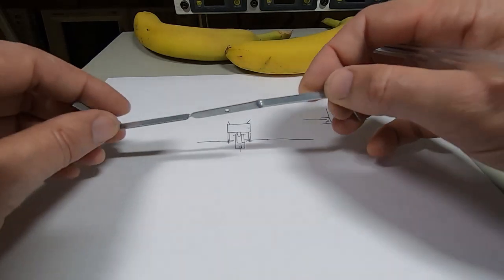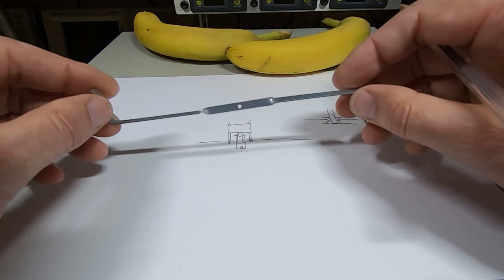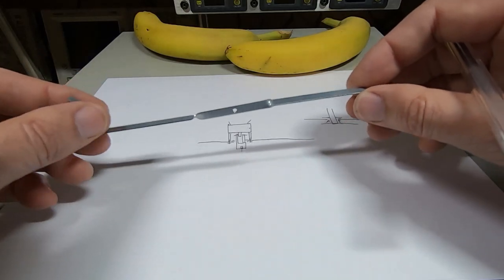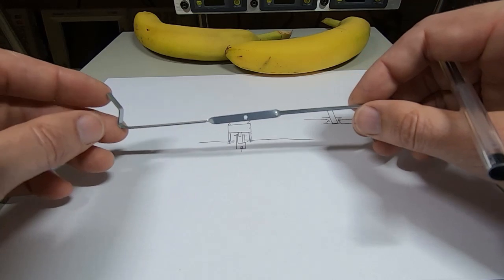The fan is positioned above the heaters. I keep calling it a fan, but it's not really a fan blade. As I said, it's important to understand this is not trying to circulate a lot of air around the chamber. This is just mixing the air above the heaters and creating a bit of circulation.